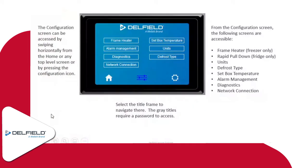So the configuration screen is going to be the one with the three lines and the three dots in the middle there. Again, you can get to that by swiping or just pressing that icon. These are some of the tiles that you would see under the configuration screen. This is a freezer setup on this screen. It shows the frame heater, alarm management, diagnostics, network connection, setting box temperature, the temperature units, and the defrost type. And we'll talk about all those different things in a little bit.